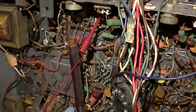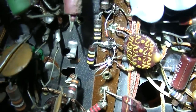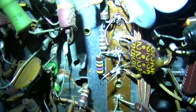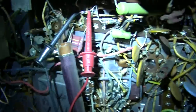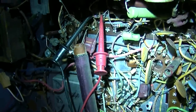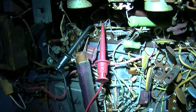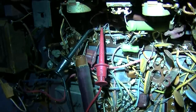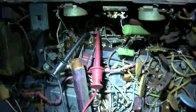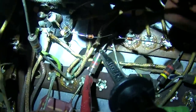Two blanking gate diodes blown - they connect to the 1500-ohm resistor point, so they're not regulating the voltage now. That's why it ran away - the diodes are gone. Going to replace them with a couple of 1N4148 diodes, the same ones I used for the phase detector. This is my fault - I screwed up, I slipped with the wire. It happens when you're working on stuff. You always have to blame yourself when a new problem occurs. These are silicon diodes - the ones that were in there were probably germanium from the 60s.